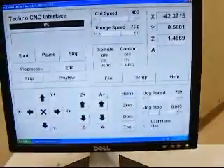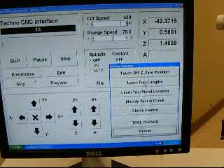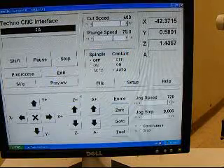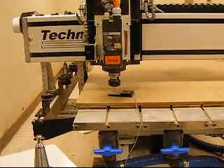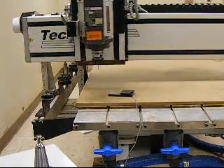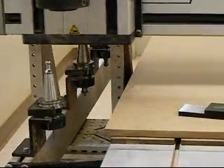Once it's over the touchpad, click on Tool and then Learn Tool Lengths. Then select which tool lengths you want to learn — we'll learn the first three, so click one, two, three, then click OK. Now the machine picks up tool one and will slowly jog down to the touchpad. Once it touches off the touchpad, it's going to pick up the next tool.